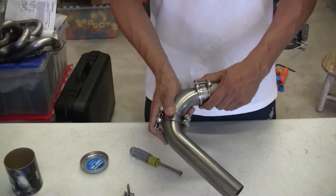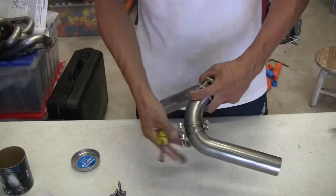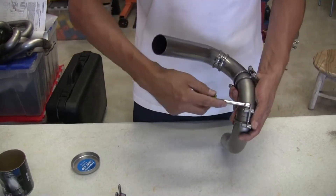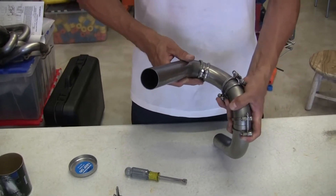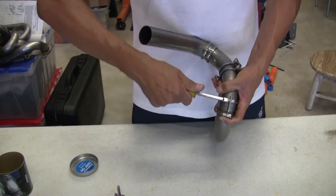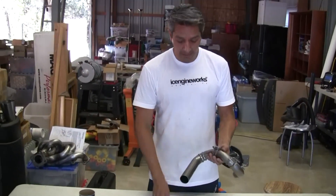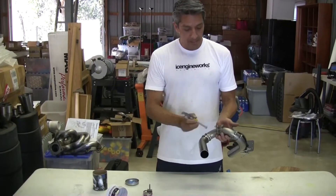We work relative rotations between each of the joints until we achieve the desired shape. For example, if we allow a joint to rotate, we can study the motion of it and the arc that it produces. If we do that with another joint, it has a different effect. This is really the power of these clamps — we are able to minutely, little by little, get to the final shape that will work for our end points, the collector of the head. When we are ready and the assembly is solid, we can confidently go to our welder and place a tack at each one.